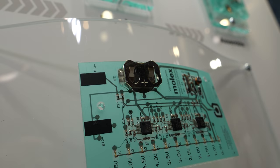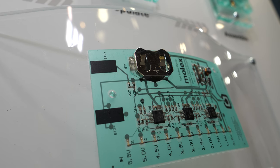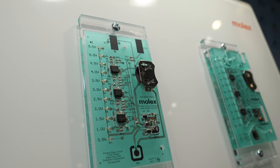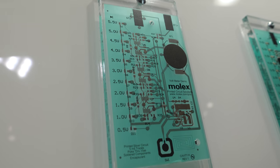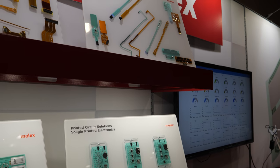Additive flex, or silver flex, is an additive process where we're adding layers onto a single substrate. This is a silk screen process and we're able to build the equivalent of a four to six layer PC board on one layer of substrate by adding layers of silver and dielectric and creating vias between top layers and bottom layers.